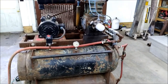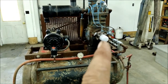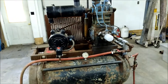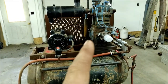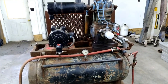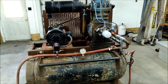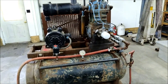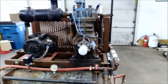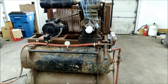I got about $250 into it when I built this thing. A hundred for the air compressor, then I had to buy a seven-inch pulley because it's a two-to-one ratio. I bought a seven-inch pulley so that I did not go over 900 RPMs. With the 1750 RPM electric motor that matches up to 875 RPMs, so that's right in the safe zone.